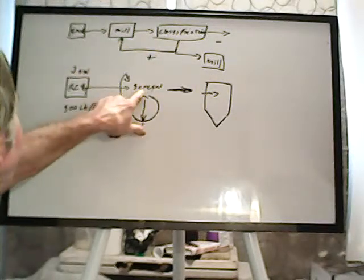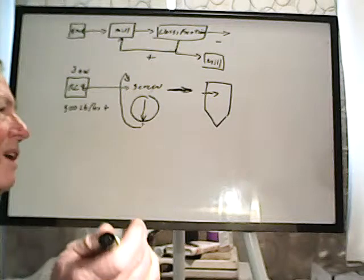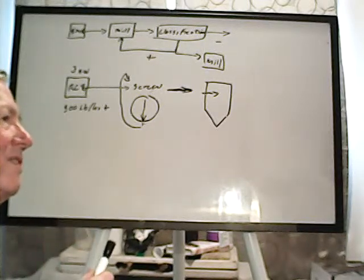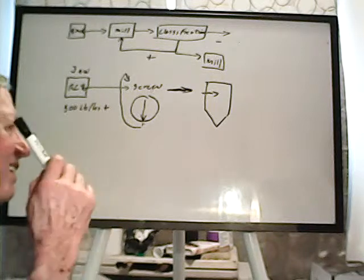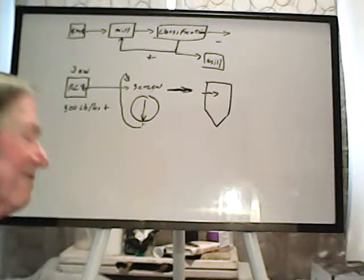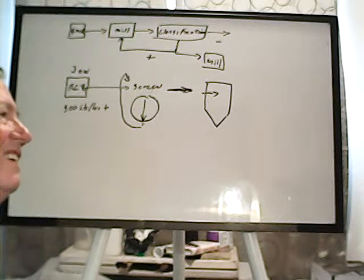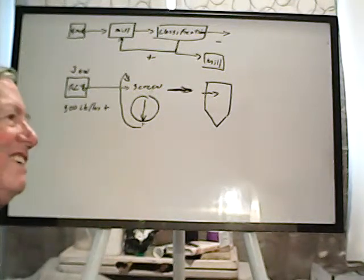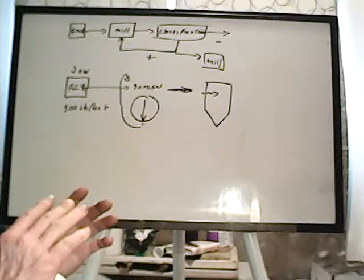this is kind of the plan, but the idea is I need to know what size screen that is. Right. So again, I got the 35 plus, 35, 60, 60 minus. I've already done bottle rolls. Oh, you have. Okay. Now, this material is dramatically different than the lower decline dump, the stuff from the pack rat. This does not concentrate when you screen it. All three fractions were within 5% of each other in terms of the assay. Really? Yes, absolutely. It is very consistent. So you didn't get any real change there at all. No concentration with screening. Well, of course, you're talking gold that's so fine that you can't see it. Probably. Well, yeah, but the pack rat Penthouse stuff, it doubled the grade when you screened it to like 1/4 inch. It doubled the grade. So that's interesting. It is.